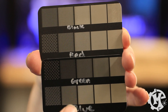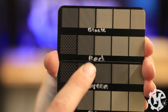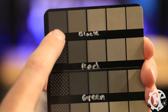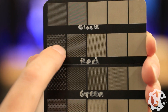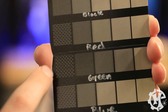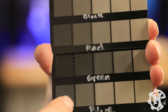I did the same thing on anodized aluminum — first row black, then red, green, and blue, across 75, 150, 300, 500, and 1000 DPI. With black there are gaps that appear more as lines. With red you start to see more spacing. Green is almost a mirror image of black, where the negative space is opposite. Blue is an in-between with a little less negative space, but still that line effect.